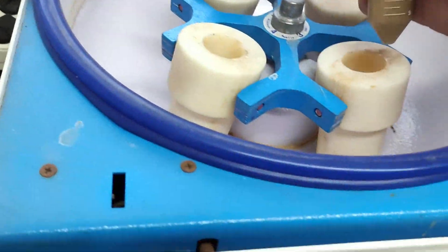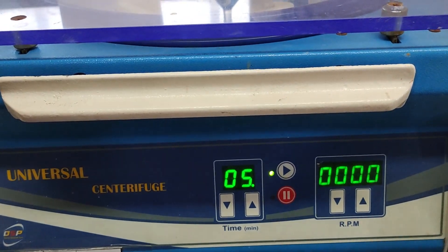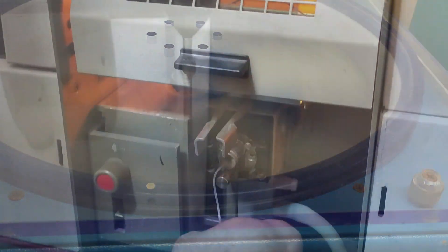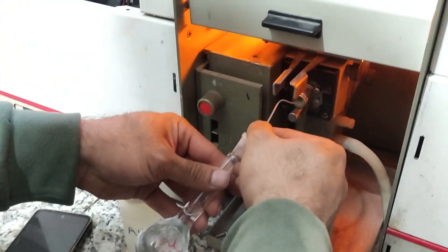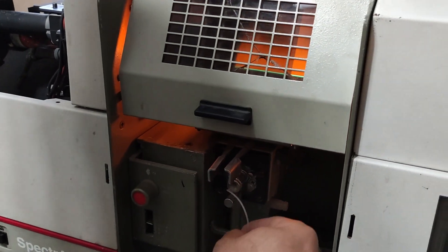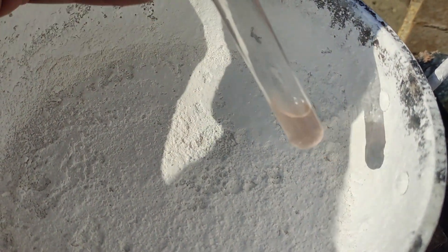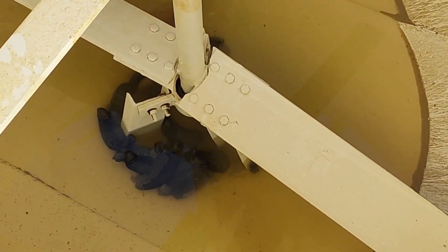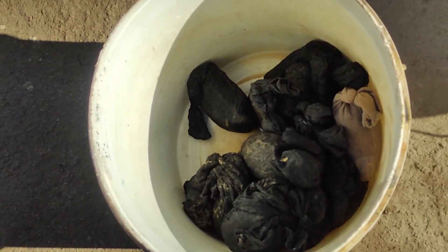The pregnant solution is continuously monitored using an atomic absorption machine. Initially, samples are prepared and analyzed with the machine to ensure accurate measurements. Additionally, the gold content is tested visually using stannous chloride for a quick qualitative assessment. The gold in the solution was absorbed onto the activated carbon in a process that was completed in 18 hours.